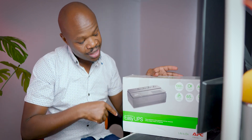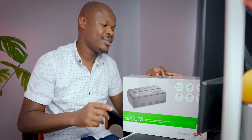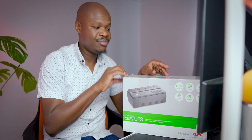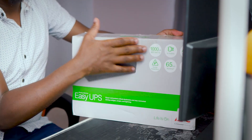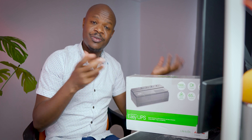So what do we have here? This is a unit by APC. APC is a brand from Schneider Electric — or so it says somewhere — based in the US. APC comes quite highly recommended. There are so many brands on the market from China and elsewhere, some of them the quality is questionable, but APC is what you want to go for. On the box you can see a bunch of specs: 1000VA, that is 600 watts — that's the battery capacity. You want at least 1000VA, especially for a mid-range PC, which will give you around five to ten minutes of runtime to save your work before your computer shuts down.